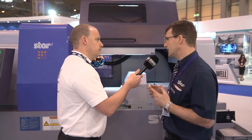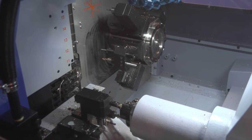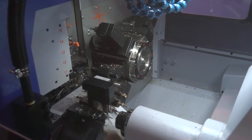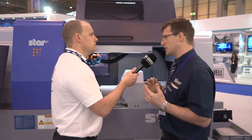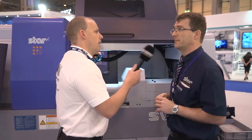Naturally the cycle time will be reduced. We've also got a feature called Star Motion Control, which is standard on this unit. This basically turns a standard NC program into a hybrid program — it reduces idle time by minimizing acceleration and deceleration and smoothing the whole process. It's a very useful feature, just for taking another three to four percent off the cycle time.